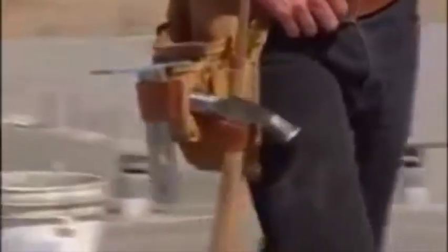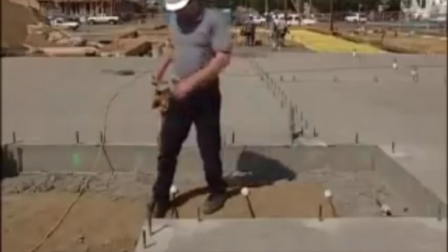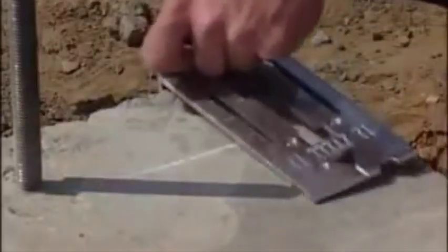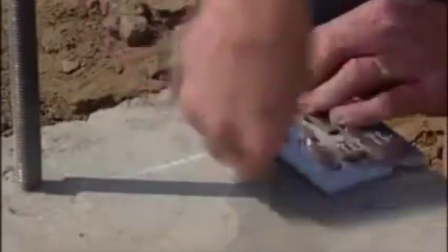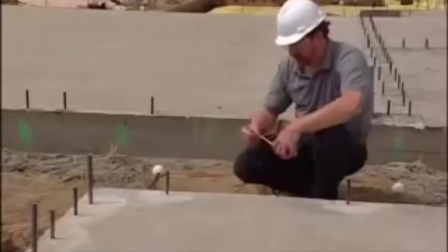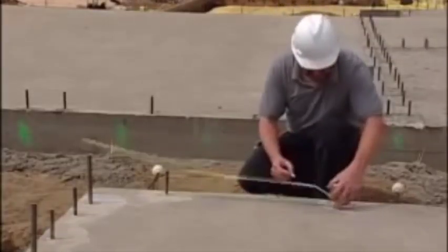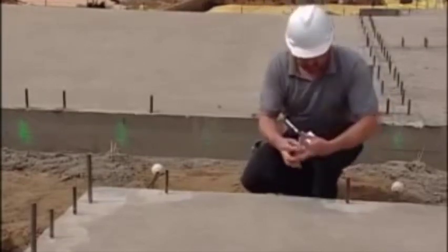You'll be surprised at how easy framing can be. Watch what this tool can do. Preparing for chalk line layout, starting on the slab corner, lay the tool as shown and mark both ways. This tool is the exact width of a 2x4. Then measure for center partition walls according to your plans. After locating middle walls, place the tool on the center point and mark on both sides.